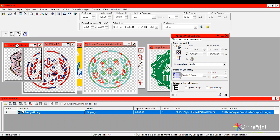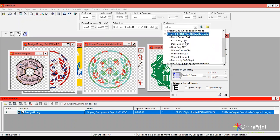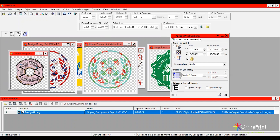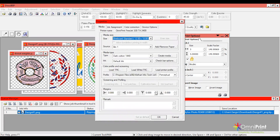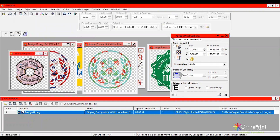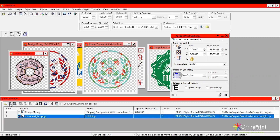Next we look at the donuts graphic. Same process — this is going on the gray shorts, which are also cotton, so we do dark cotton since it's not black or white. We'll increase the size to five inches, top center, and select the port. We'll put a 0.75 inch margin since we have the shorts loaded up where we want them — we just need to drop it down so we're not printing right at the edge of the platen where it curves. Click OK. Same thing: Image, Add White Underbase Choke, click OK. Add it to the queue and rip the job.